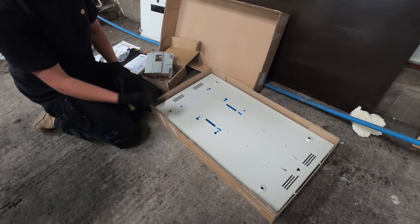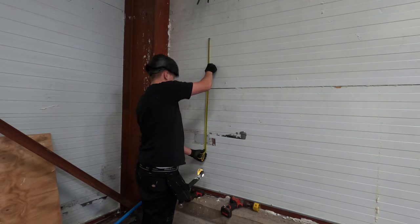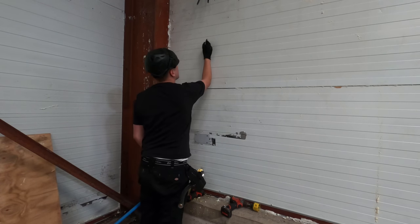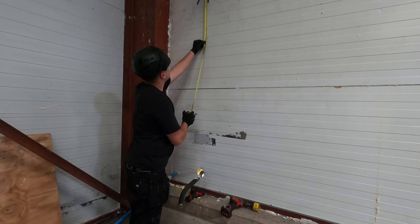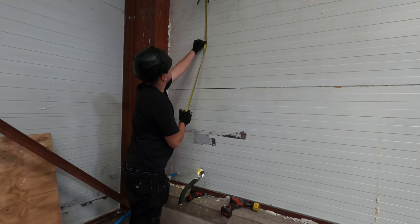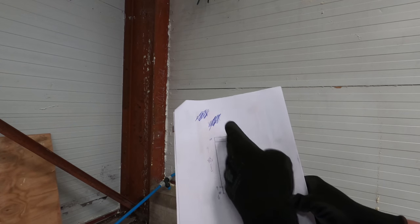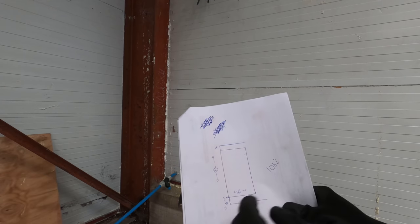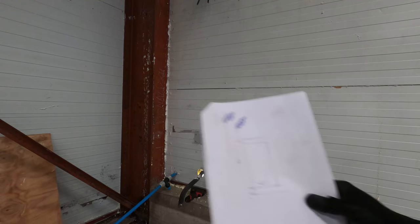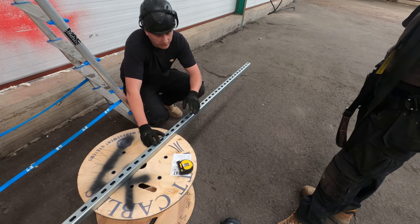From edge to edge we're looking at 365mm — that would be the same for centre to centre. So our upright unistrut on the wall wants to be 365mm apart. That would be the top of our header trunking, but then we need to go at least another 700mm up for the other trunking to sit nicely within the enclosure. So I'm probably going to do that on a separate bit of uni. Basically a rough drawing — we've got our board here, trunking below, trunking above. The main thing is keeping the bandsaw straight, probably won't need ear defenders to be fair.